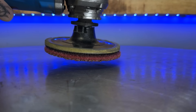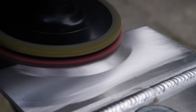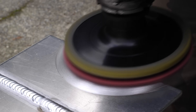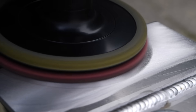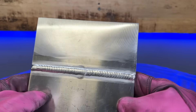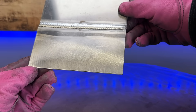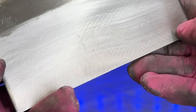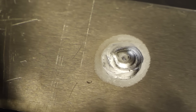I'm going to start by using the exact same area of my grinding disc, but at this point I'm going to make sure the grinding pad stays very flat. Again, I'm going to point my grinding direction so that it roughly follows the grain direction of the base material. Because we're now using a less aggressive pad held completely flat, this allows me to be a little bit braver with my grinding. We can now take the rest of this reinforcement down all the way, basically until I've completely blended the welded area into the base material. We can see things look pretty good — I haven't dug into the base material too much, I've spread my grinding around, there's no reinforcement left behind and no sunken or hollow spots.